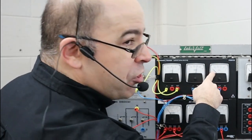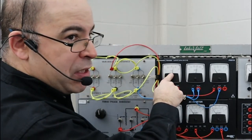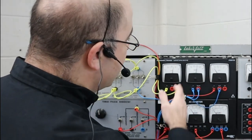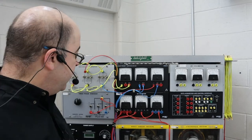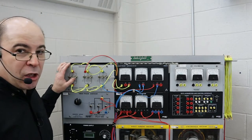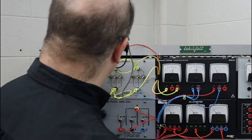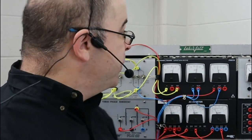The current is staying stable. We are registering a current increase, and you'll notice the voltage is climbing up ever so slightly. The shunt field current or magnetic flux is staying steady, but it is increasing slightly. The current drawn by our synchronous motor is starting to increase. I'm going to start closing the 600 ohm switches next. We can see we're drawing almost a full ampere of current from the generator. The shunt field current is staying pretty stable at 300 milliamps, and the voltage has climbed ever so slightly — just at about 126 volts.